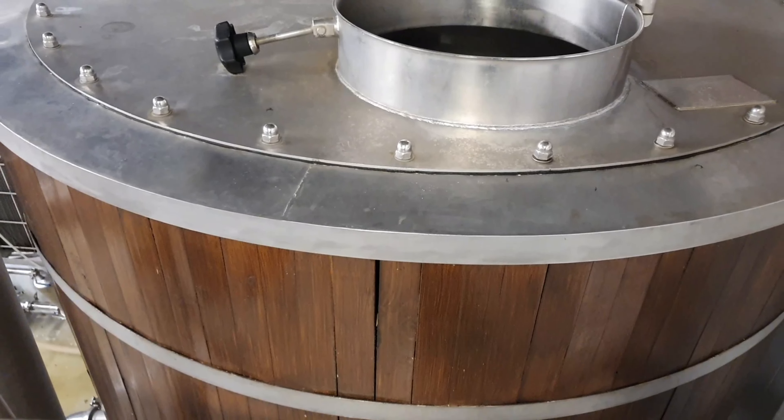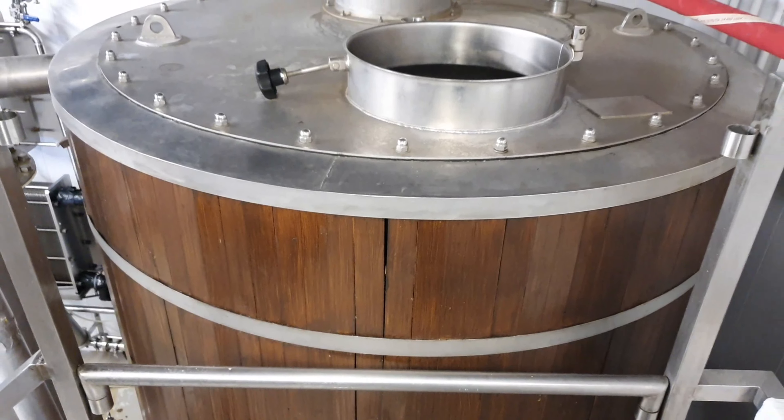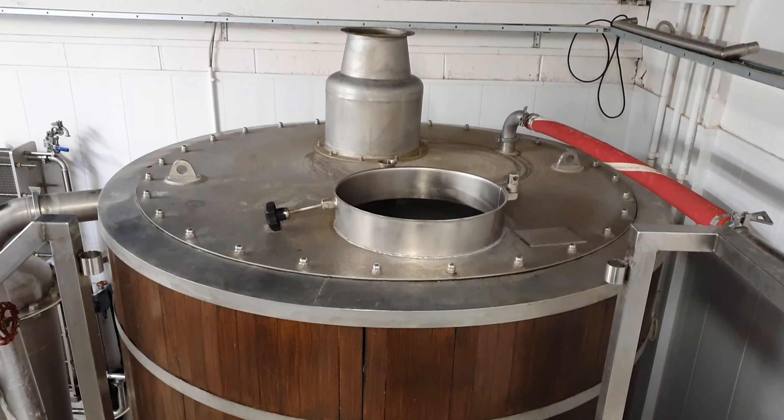You can probably hear it behind us — the kettle is going, Ian has fired it up there, and we have steam going into it. So this big long tube that you see behind me is an external wort boiler. It's also called, for any engineering or technical people, a shell and tube heat exchanger. So the wort is going up through tubes — there's about 40 tubes running up through it. The steam goes around it and we get an energy transfer, so the steam ends up heating the wort to bring it up to boil.